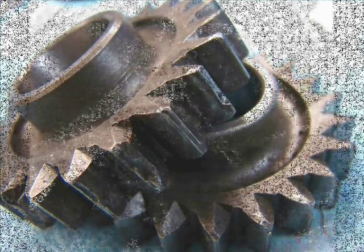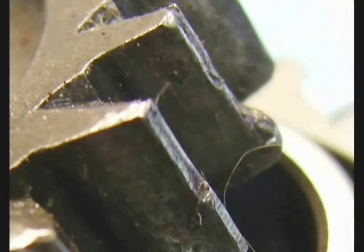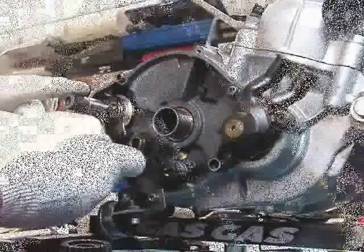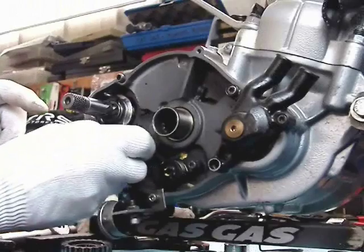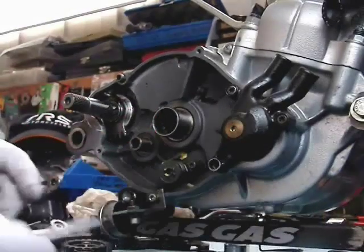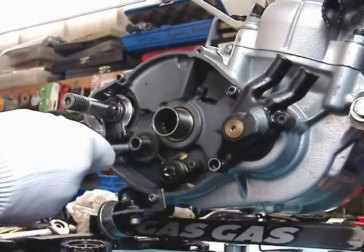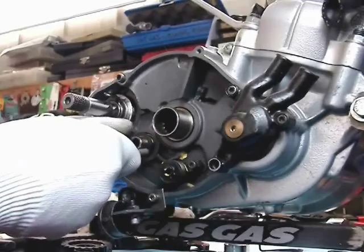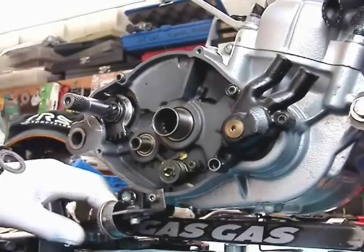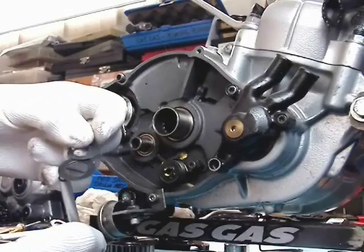In fact, it can sound like you have bad crank bearings or some other type of serious problem, when in fact it's a gear that's chipped or more than one. That gear rotates all the time when the engine's running. That's the bearing that it rides on. Behind it is another flat washer, which is identical to the one on the front of the gear, so don't worry about confusing those. There's one on each side of the gear, and the outer one removed previously is exactly the same.